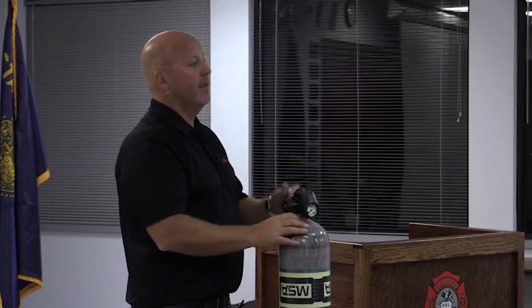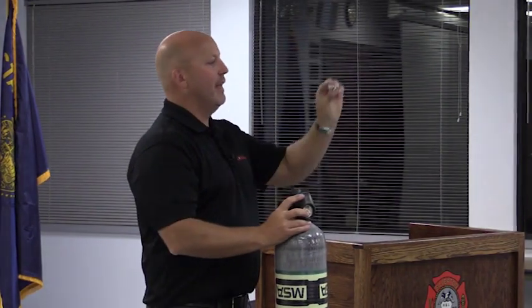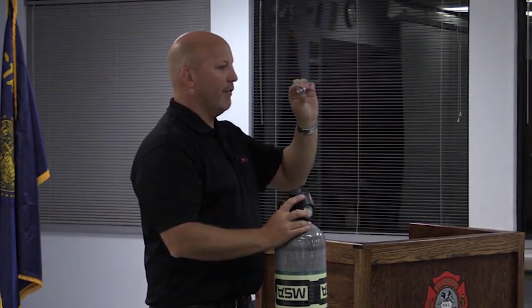What we want you to do is tag that cylinder with the fitting and let your SCBA technicians retorque it onto there. Does that make sense to everybody? I was asked to make sure I made that crystal clear. I think I just did, but if I need to say it again, I will. If the fitting comes off, have your SCBA technicians torque it onto there.